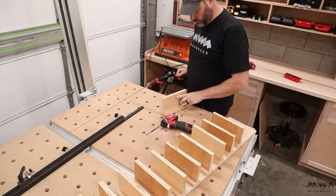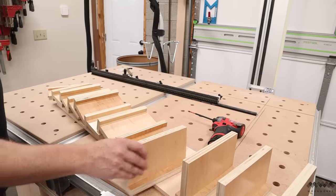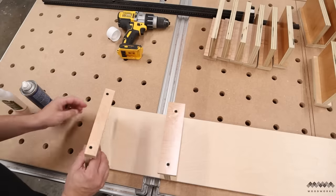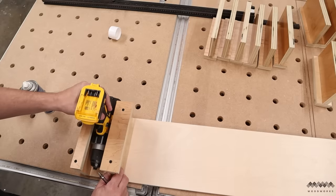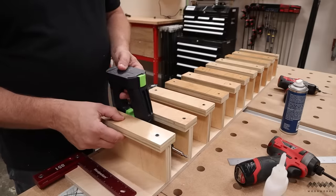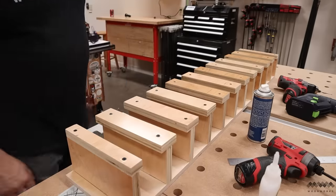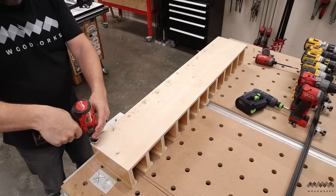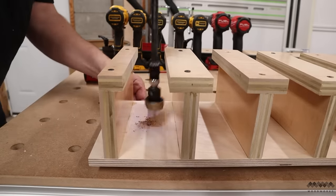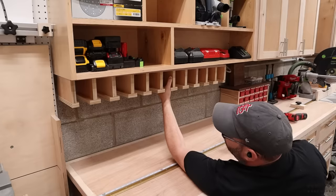You can make as many or as few of these T-shapes as you need. I'm going to attach all these tees to a single strip of plywood so that everything is one solid unit, which is going to make it way easier to install. Using super glue here makes a nice temporary bond — just enough to hold them in place while I test the fit with a drill so I know how much gap to place between each one. I'm trying not to make the fit too tight so that I can put different drills in different spots and don't have to remember the exact order they go in. Then I can turn the whole thing over, countersink some pilot holes down each side, secure everything with screws, add pilot holes to the top for installation, and screw it into place.